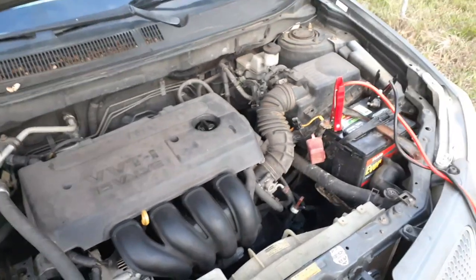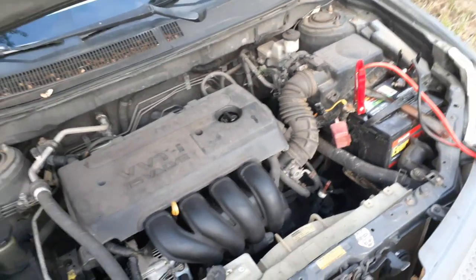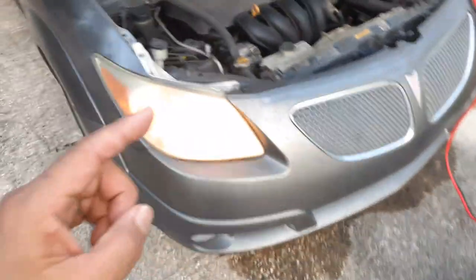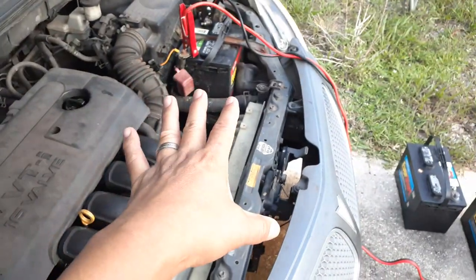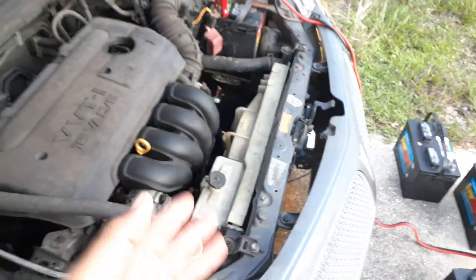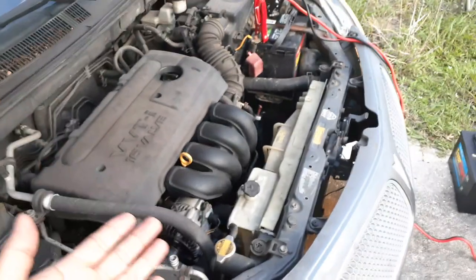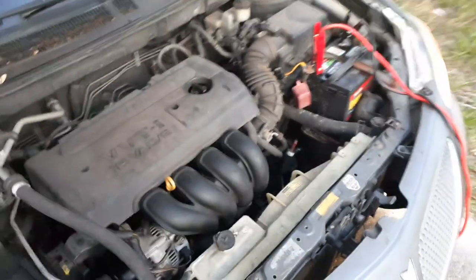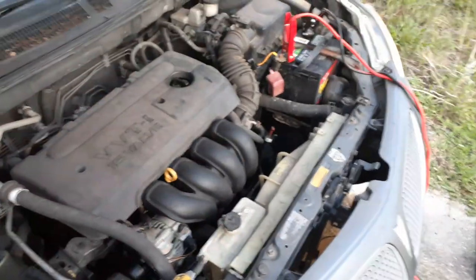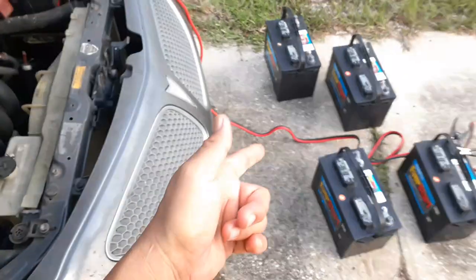So my little blue didn't have solar panels for the longest time, but then because I had access to a used solar panel, I went ahead and installed a 200-watt solar panel, which is actually perfect for living in a vehicle. Ideally you'd want about 400 watts because that would allow you to cook off solar entirely, using 400 watts to run a 300-watt rice cooker. But with a 200-watt panel and a battery bank of roughly 200 amp-hours — 100 usable — that's enough to run a rice cooker and cook a meal each day. And then you can charge it back up off the alternator as well as off the solar panel. If you're running the solar panel while you're cooking, the car could be turned off and it shouldn't drain the battery too low because the solar panel is putting 200 watts back in while you're pulling 300 — so only 100 watts is being pulled from the battery to cook your food.